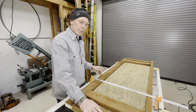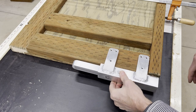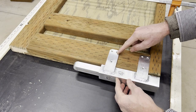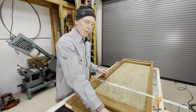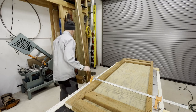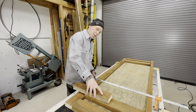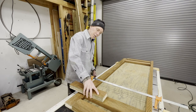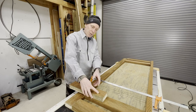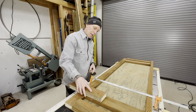The end of this is going to take the aluminum piece, and I'll show you. I'm going to need to recess the tabs for the aluminum piece to sit on the corner to key these things together. And then this piece here in the middle is where the stake is going to attach. That's going to drive down into the stake pocket, and so I'll need to relieve this piece, that thickness. It's about 7/16. I need to relieve that.